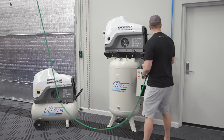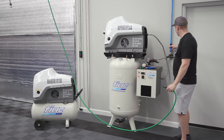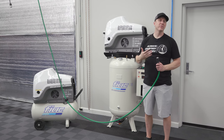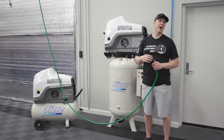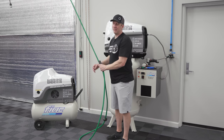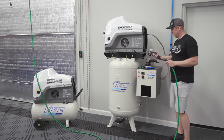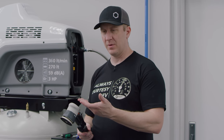My system is aired up. If I was concerned about leaks I could turn the system off. I also have a valve on my lift and a valve for each hose reel — so if a hose reel broke I could turn its valve off, swap it out, and keep the system running. In a garage like mine we're not dependent on this for daily work; it's more of an 'I've always dreamt of having an air compressor' situation.